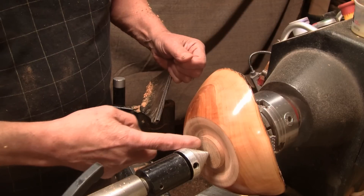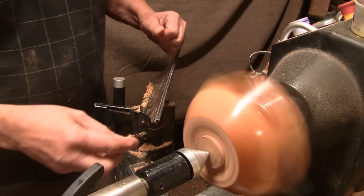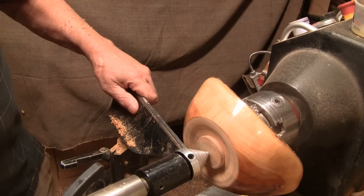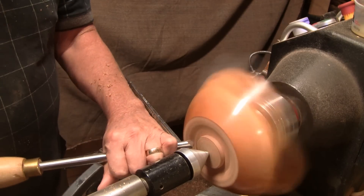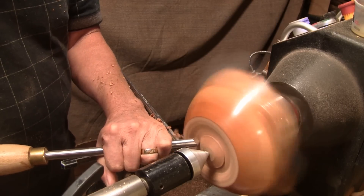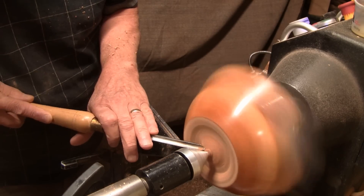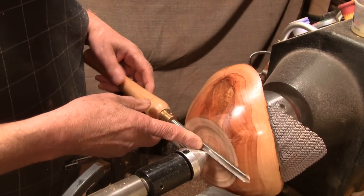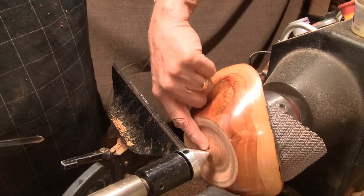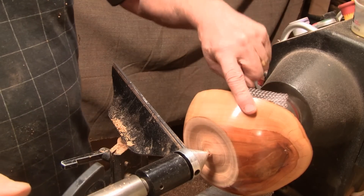I want to do a little sanding here and I just need to take that tenon down just a little bit to get below the base. I'm going to use a half-inch bowl gouge to just take that down a little bit. That should be below the base — and it is. So I really don't have a nub to take off. I'll sand this up on the bottom and get some finish on it, and then I'll come back and tell you what I did differently with the finish.